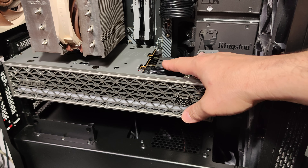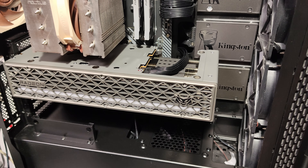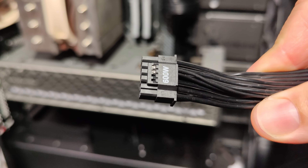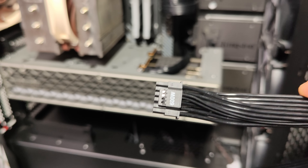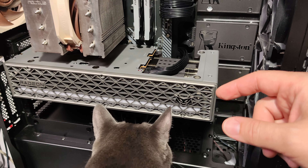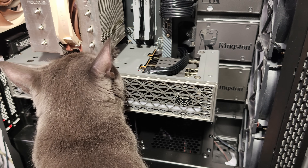We get that lousy connector — the 12-volt power connector, this one. You know that this connector usually catches fire on GPU cards. It should not be an issue here as this connector is rated for 600 watts of power, and this card will draw around 330 watts in my tests, so it should not melt down.